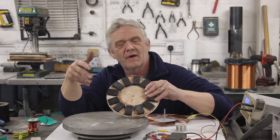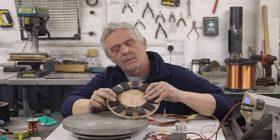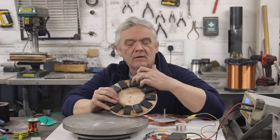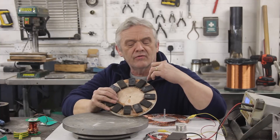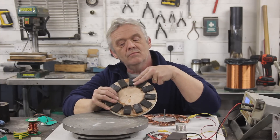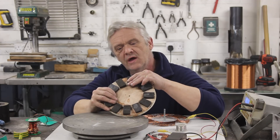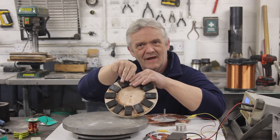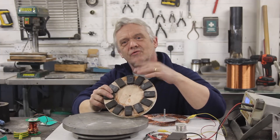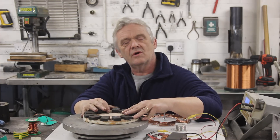In order to correct it, you have to think about what's happening with these magnets. I've glued some magnets onto a wooden base, arranged in north-south, north-south, north-south. When we wind the Faraday coil, we begin here and go to here — by the time we're wrapping around, we get a bundle of wires over that magnet. They move around changing from north to south, but equally there's another bundle of wires right next to it moving from south to north. They're completely opposite, so they'll fight each other and you'll get nothing out.